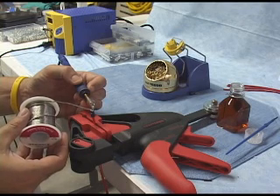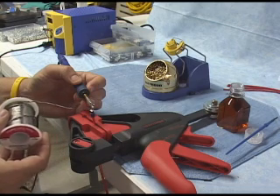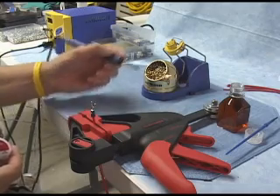I'm applying the solder from the front of the terminal — the joint where we can see the terminal and the ends of the copper stranded wire. We're going to place the solder there. The solder will start to flow and melt. Once it starts to do that, we only need a teeny, teeny bit of solder to make these joints. Once we see the solder starts to flow, we're going to remove the solder. We're going to leave the soldering iron tip on the back of that spade terminal for about two seconds — count to two: one, two — and then remove the tip of the iron.